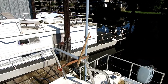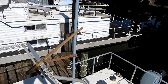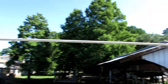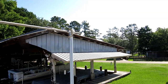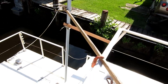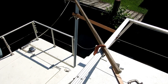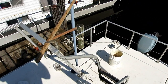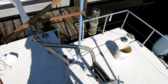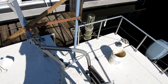It took a little doing, but both of the rear tall posts are level both ways, they're the right height, and I've got a three-quarter galvanized pipe laying across to get the little brackets lined up with each other. This is where they're going to go. I'm going to go ahead and cut and try to fit the braces to this back deck. This will be permanent stuff except I haven't put caulk under the feet because everything's so wet this morning — as the day dries out I'll take the feet off, caulk them, and put them back.